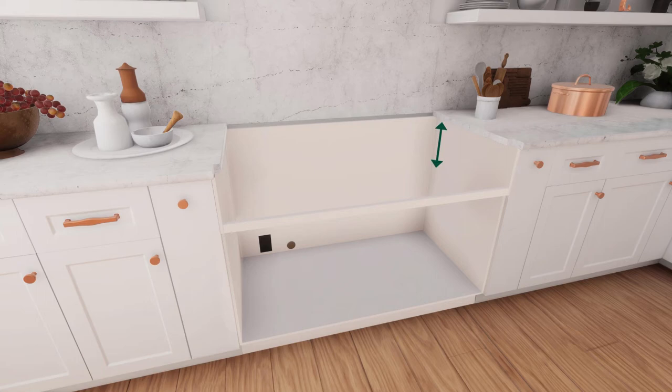To cut the countertop opening, allow 8 inches free space below the surface of the countertop. Allow additional clearances below the burner box to install the regulator and make house supply connections. Use a 90-degree elbow to route the gas connections and limit interferences with drawers or other cabinet features.